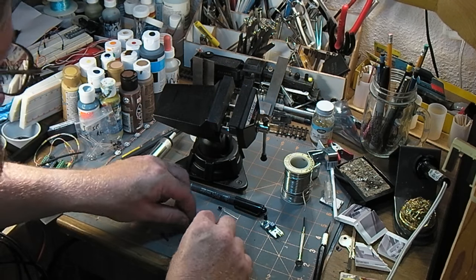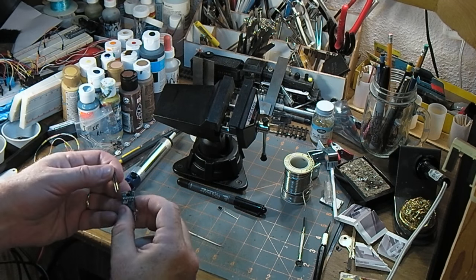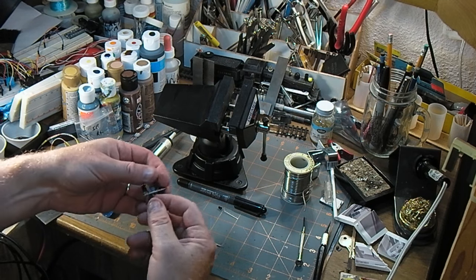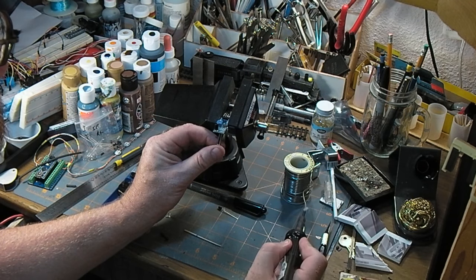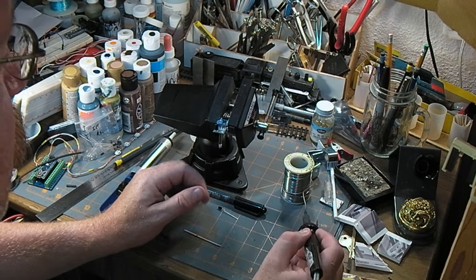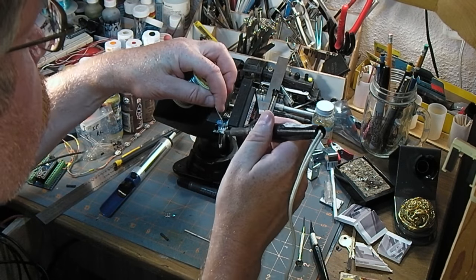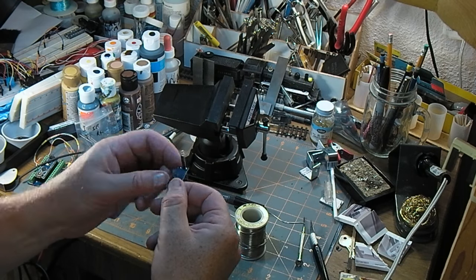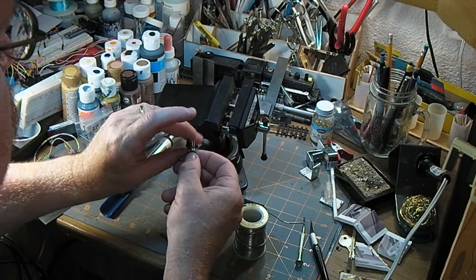Heat shrink out of the way. I'm going to put that just on the inside — I don't need it on both sides. I mean, I could, I suppose, but I'm cheap and I'm lazy. Pick up a little solder and just tack that one in place so it holds. I didn't even get too much heat on there for the heat shrink — I could shrink it, but I'm not going to bother. Now I'll just repeat with the other one. I think I'll leave those leads long until I get it installed, and just know that it's exactly where I need it to be.